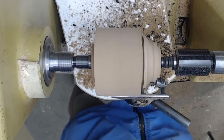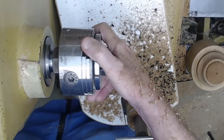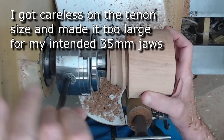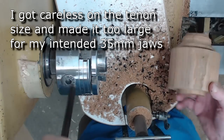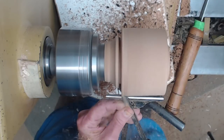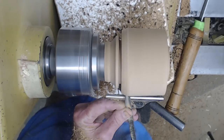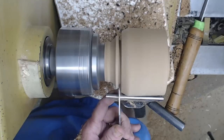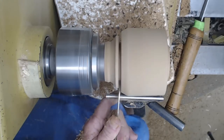I'm going to have to do some of this on the box. I'm going to use these 35mm jaws — these are Record Power so they are not a dovetail. I don't know what I was thinking, but I think it'll get in there. I'm not going to worry about a perfect tenon. I'm going to leave about maybe a quarter of an inch. It's got a short handle so you've got to be careful on these larger pieces — you don't want it to bind up on you.